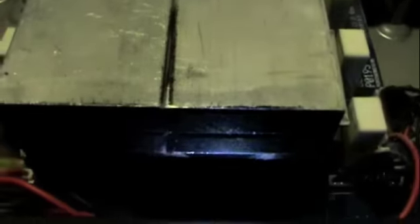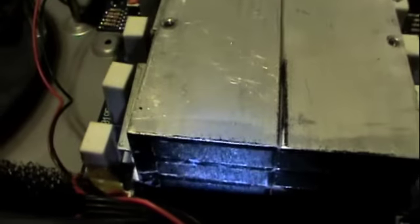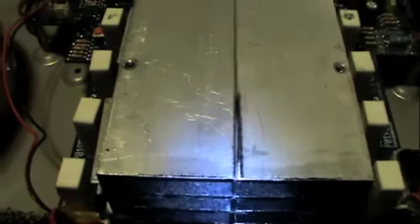I'm going to try to show it to you. If you've already been in the amp you know what I'm talking about. It's got a massive heat sink that's finned, with the fins facing in. See these fins? If you leave it the way it is from the factory out here, those are going to fill up with dirt and dust and eventually clog up, and then it won't cool off anymore. Your power transistors on the heat sink — some of them are voltage regulators; the two little ones are voltage. And then you've got the big ones there on both sides.